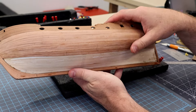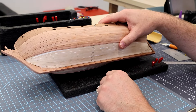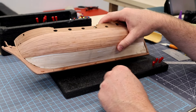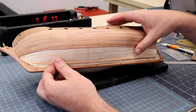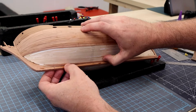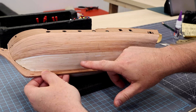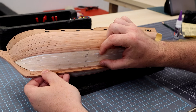As we press along, there are a couple of things you can do. I started in the middle here and calculated how many more planks I'd need to finish - it works out to 10 per side. A semi-common thing to do at this point is fix your bottom plank in position and then start working your way back up. The reason for doing this is that you'll end up with a funny-shaped plank somewhere in the middle - one custom piece. It's worth checking this out ahead of time because if that plank is wider than the boards available, you're going to have to do something.